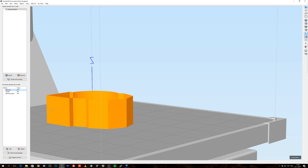Then I'm going to print 5mm of height in under extrusion, and this under extrusion is going to be printed at a lower extrusion rate. And then we're going to print normal extrusion again. So we'll see a block, and that block will show you what happens when you're going to under extrude. So let's take a look at this setting and at this print.